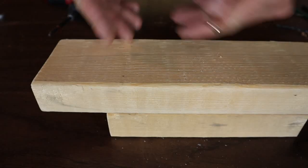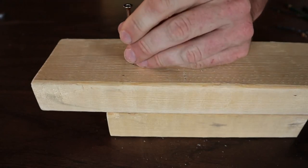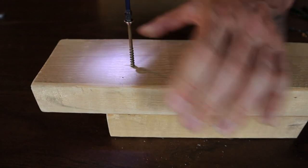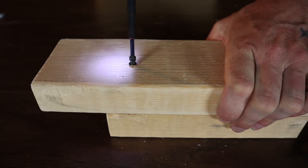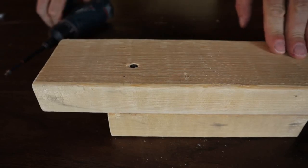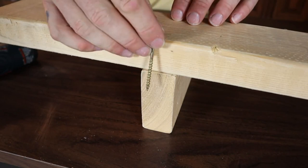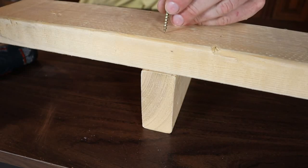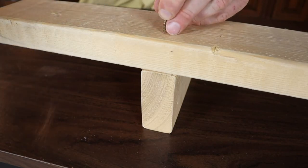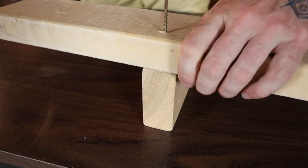You can do two screws side by side and that makes a really strong joint. For a finished piece you could countersink the hole and it would look just perfect. For just 2x4s, don't be afraid to drive screws right in — press down hard, go slow, and that's going to ensure the screw goes in really well and tight. Pay attention that you're centered, not to one side or the other, because that's going to cause the wood to split out.